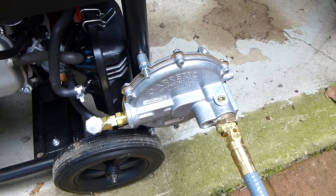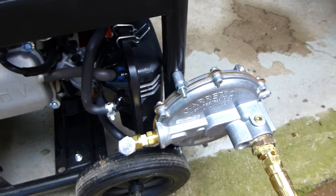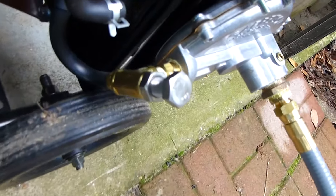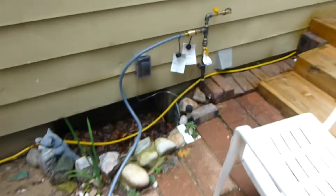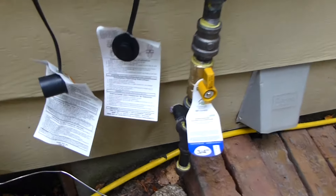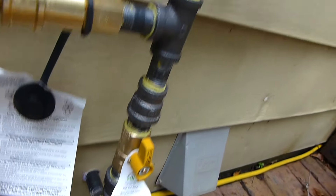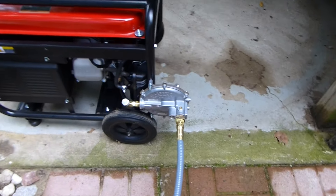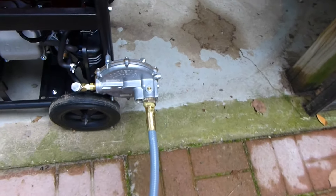I've got the shortest possible distance between the snorkel and the regulator. The regulator is not mounted in the direction the arrow calls for, but I tried it in that direction and it made absolutely no difference. I have the adjustment screw all the way out, and at considerable expense and their recommendation, I upgraded to a full bore three-quarter inch valve on my half inch pipe to a half inch flexible hose — I had a three-eighths inch before. I can make a five-foot flame off the three-eighths inch; I haven't flamed off the end of this one, but there's plenty of gas there.